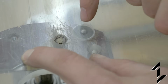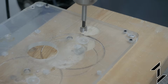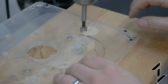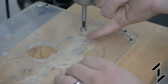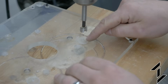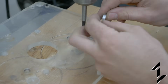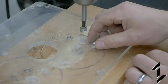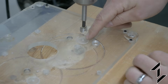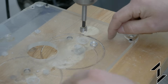Perfect. So now I'll drill a 1/2 inch hole centered there for the dust cover insert. Now they don't necessarily advise to do it this way, but I'm gonna try drilling this from the top and not go all the way through the acrylic to where I drilled up from the bottom with a 3/4 inch bit. The thought is, if I can drill just the depth of this insert and then drill out the center, I still can have access to that hex key, but this won't be quite so low in this top piece.